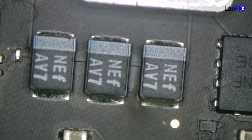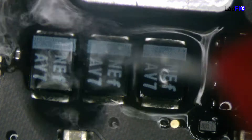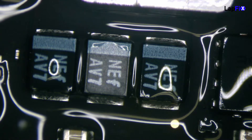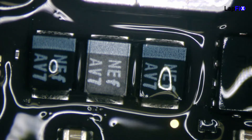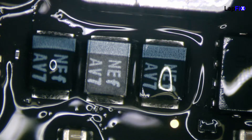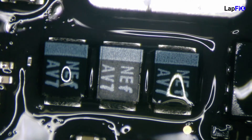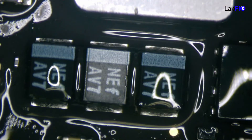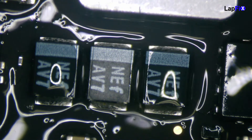Watch this — we're going to get a little alcohol, and even though it's on right now, we're going to spray it and see where it's getting hot. You can also use a thermal camera for this, and we might do that soon. Oh man, you can see that middle one — it's pulsating! See how it dried around the rest and the other ones are still liquid? That's your obvious candidate, the one in the middle. Let's unplug it and plug it back in to confirm.